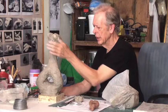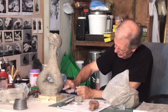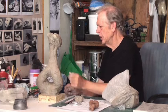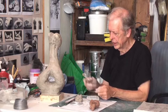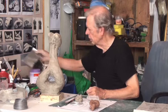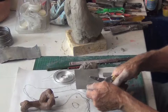Now what I do is I hold it to the light. That's the best way. And where the shadow forms dictates to me where the line will be. So I put these little shims in that I've got over here. What's it called? A shim. What I do here is I take an aluminium can and I cut it in half and I cut these little pieces out of it. This is what the can looks like when I've cut it off. I just take a little pair of shears like this, about an inch wide.